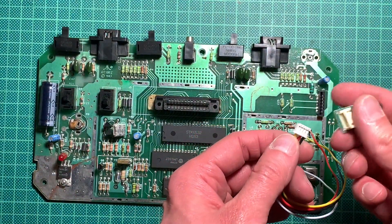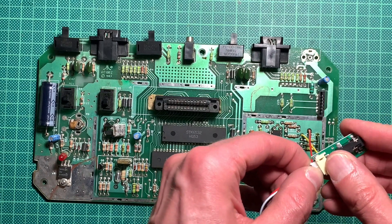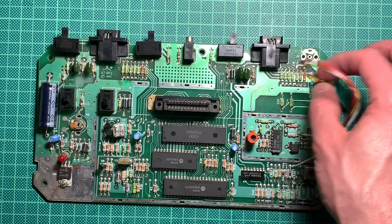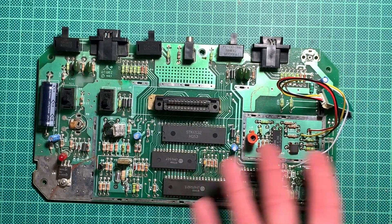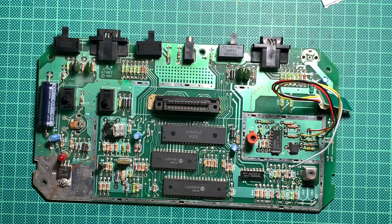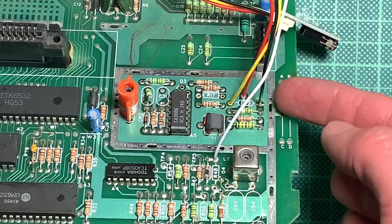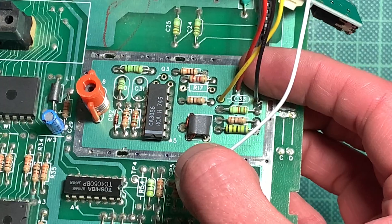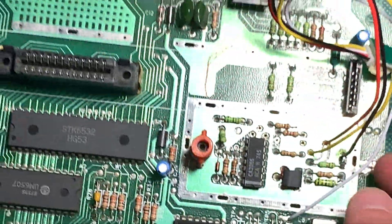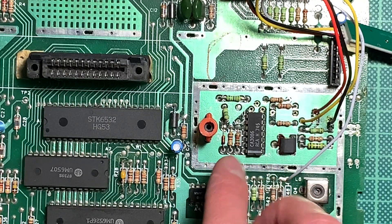And that's the mod installed, more or less. Now comes the more tedious part — we can plug this in like this and mount it here. But first I want to brush down all the dirt and grime. Then we can reassemble the whole thing and try it out, hopefully it will still work. One more thing so that you can see where I actually put the wires: here R48 is the audio out, near C33 is the ground wire, and the red and yellow wires for the video come out on the top and on the left of C33. This is hopefully good enough documentation that you can mod your own Atari 2600 Junior without the RF box.